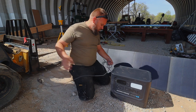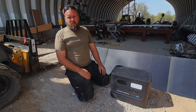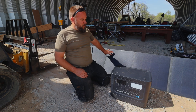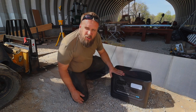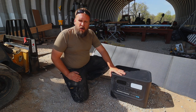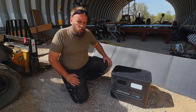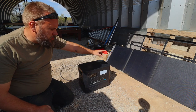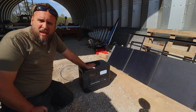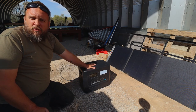Quick and easy — you just unfold it, plug your power cord in with the same round fitting, and you're plugged in. This unit can take four solar panels; you buy little splitter boxes. With two panels I'm currently charging at 79 watts because the sun isn't hitting it directly. After rotating it toward the sun I'm getting 133 watts and it will charge in 2.7 hours. With both panels facing the sun we'd be getting about 266 watts and charge in roughly 1.4 hours.